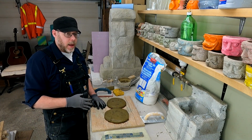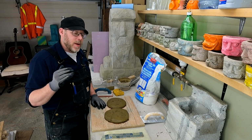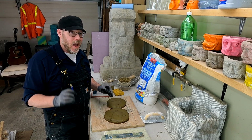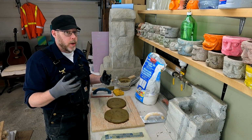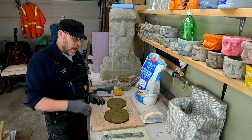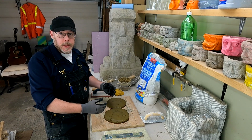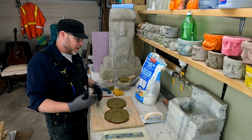And especially if you're talking about anything larger, and especially anything with straight lines to it, because if you have something that's like a 40-foot long wall and it's straight and you have tiles on it, you can see from outer space if it isn't actually a straight wall, because the tiles just create this visual draw where you can't help but notice that there's a bow where the tiles run even or something like that. So if you can, the more you can do to give yourself a flat, even, plumb, square profile to what you're going to apply these mosaic tiles to, it's going to help you out a lot. So let's talk about some ways that you can go about doing that, because it's hard to do.